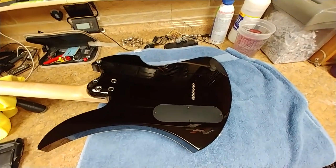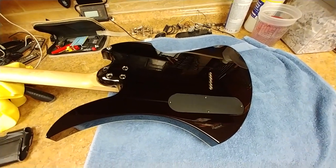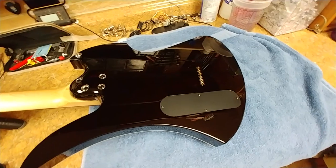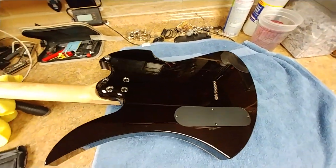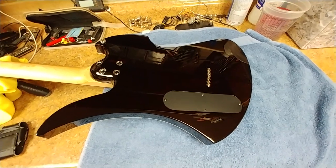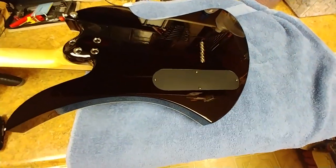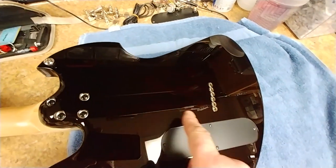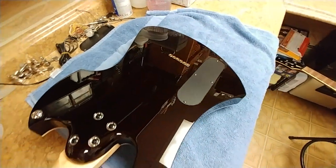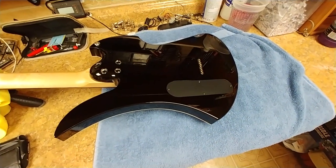So when you do the steps with the sandpaper, starting with your coarse and working all the way up to your lighter paper — which in my case was 3,000 grit sandpaper — that 3,000 grit sandpaper makes it really, really easy to polish out black. And black is the hardest thing to polish out because it wants to fog on you. Instead of on camera, black won't look black — it'll have like a gray to it, it won't have that deep black look. Now, this is a transparent black because you can kind of see the wood through here a little bit. So that's what hand polishing can do if you follow the steps with the sandpaper, and the sandpaper makes a big difference.